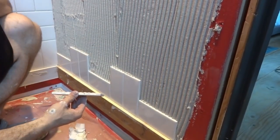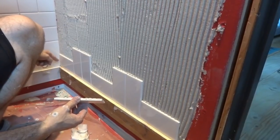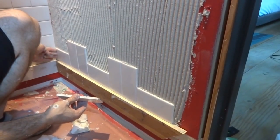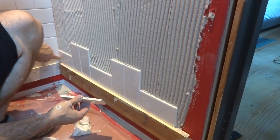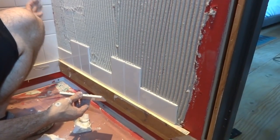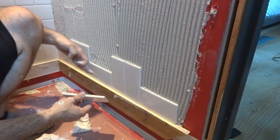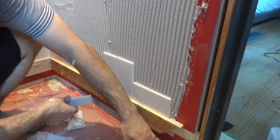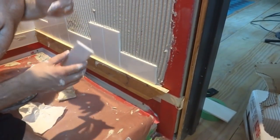Now that the back wall is on, we're working on the side wall. I started from the corner and I'm moving this way. I tried to give it just a little bit — maybe a sixteenth of an inch — back from the corner so it's not completely touching, and later we'll go through and caulk it. We've got our pattern and it ends just a little bit shy of the edge of our shower pan.